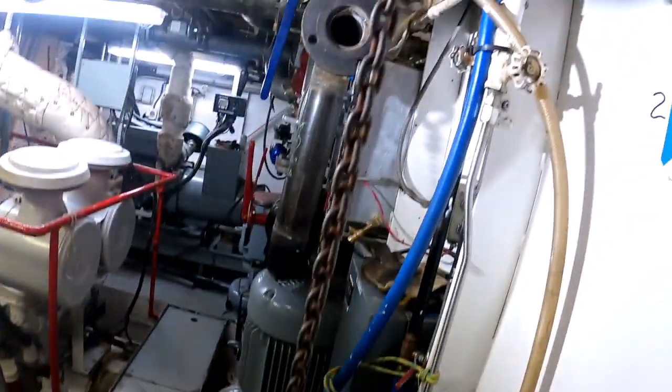For this step, I'll try to get some better lighting in here. I made a little circle cutout from a piece of paper, used a compass, and drew the outer diameter of the pipe, about 3.5 inches. Out of that, I got a center point reference. I should mention that we've got that pipe down there. To establish that location, I put some straight edges on the outside of the pipe and made a few tick marks, and it's pretty close. So that's going to be my center point.